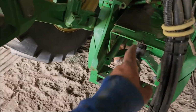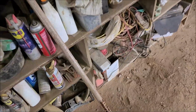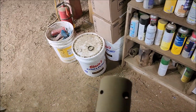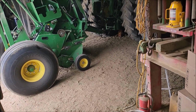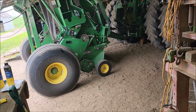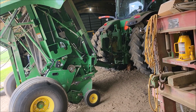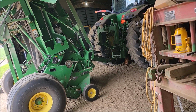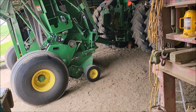This actually ties into what I was going to talk about up there. We are using a large 1000 to small 1000 PTO adapter. The 8235 and the 4640 require these to be able to put them on any of our smaller implements. The tools that we have that allow us to use the large thousands would be that red grain cart, and I believe those Kuhn manure spreaders.